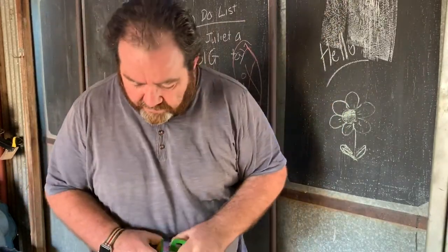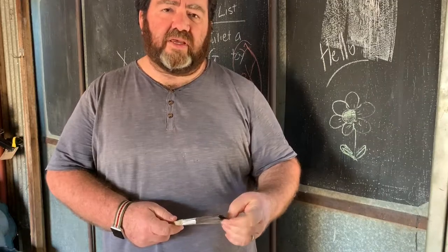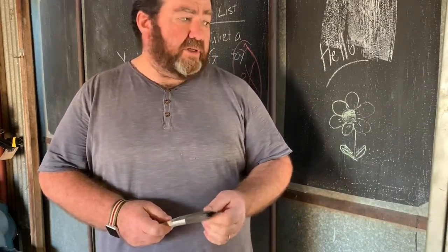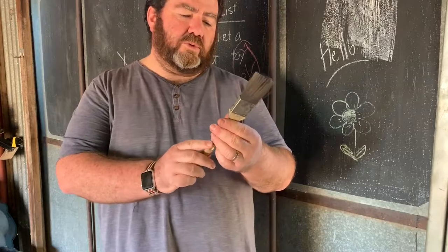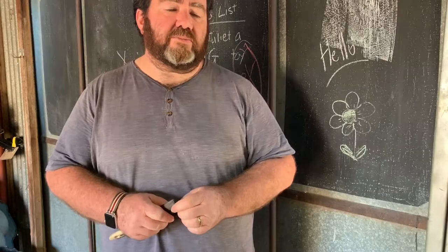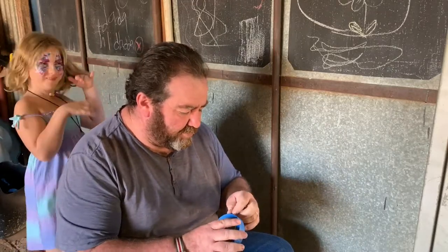We're painting today not using a roller — you could use a roller, but I'm a little wary of excess paint with the roller, especially since I know I'm only going to have just enough paint to do the job. So I'm just using a standard one-and-a-quarter-inch brush. This is oil-based paint, so you will need something like turps to clean it out. Using 3M blue painters tape again.